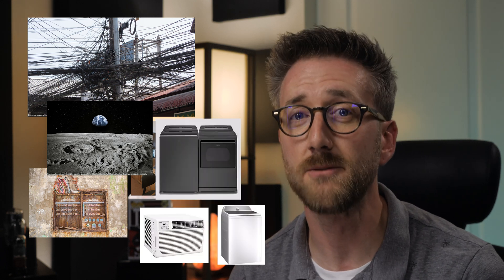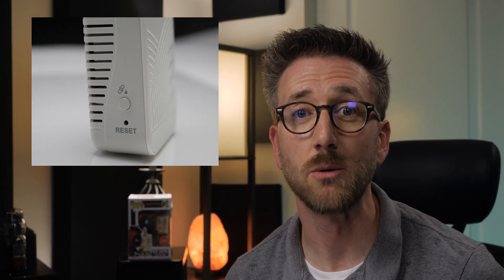Keep in mind that performance can be affected by the quality and age of your electrical wiring, the distance between adapters, circuit breakers, and electrical noise from other devices. But this technology means an older device stashed in a closet can still get a network connection even when wireless isn't an option and the room doesn't have an ethernet plug. By using a powerline adapter, you're basically putting an ethernet port on the wall using your home's existing power network.